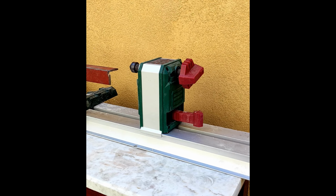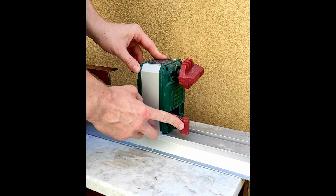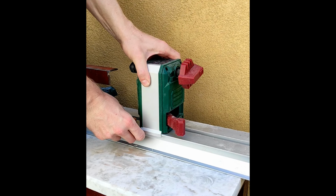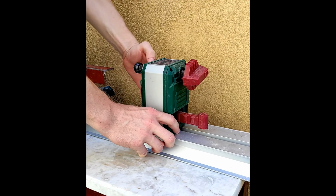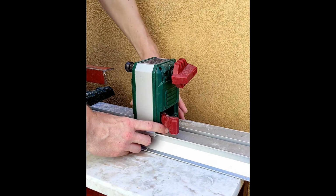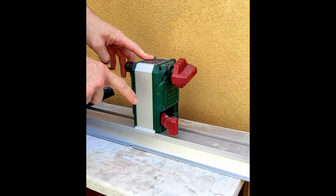The plastic body of the tailstock is rated as a big minus. An arresting lever has to fix the tailstock. When the lever is on one of the sides, the tailstock is fixed. If it is in the middle, it can be moved. With large vibration, however, the lever often releases and returns to the center, and the tailstock moves, which is quite dangerous.